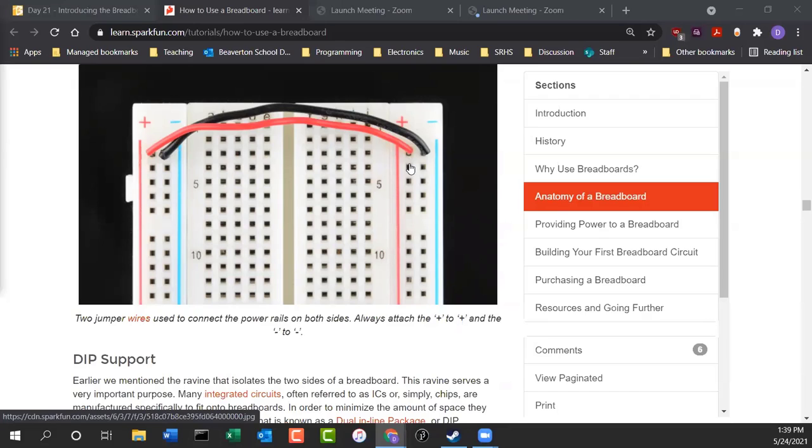If I'm going to build any kind of prototype, any circuit that's got any size whatsoever, the first thing I do is I connect the power rails. Okay? This is even before I connect any power to the breadboard. I just say, okay, anything I plug into here will be the same as plugging it over there. Basically, you're making them electronically equivalent.